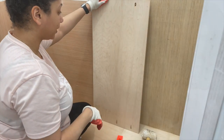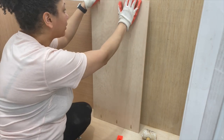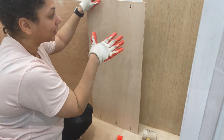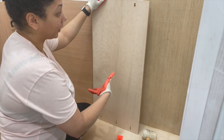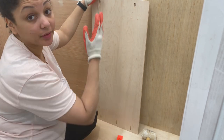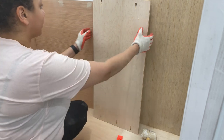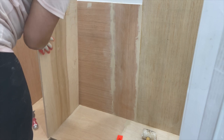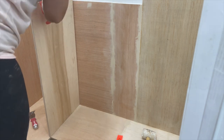The audio for this clip was pretty crappy so I'm doing a voiceover. I made pocket holes both at the top and the bottom of this sheet — this is what's going to be the side of the cabinet. I wasn't sure if I'd need both, but I did them just in case because once you install this you can't really make pocket holes after. I actually ended up only needing the pocket holes at the bottom, which I'll show in the next couple of clips.